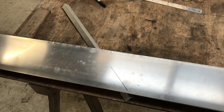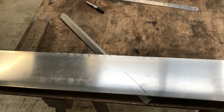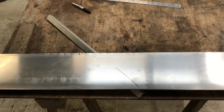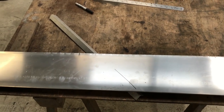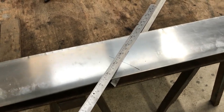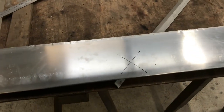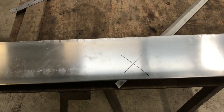I've drawn my line at 45 degrees. Now I'm going to turn the angle 90 degrees from where it is, rebalance the blade, and draw another line. This is now where the center of mass of the blade lies. We can measure how far back the X is from the leading edge and see where we are.